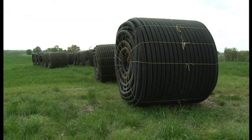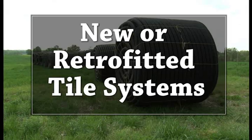I think what drainage water management does is give farmers the tools to actively control water — both excess and deficit — throughout the year, which they've really never had before. So it brings a whole new level of management capability to their operation. Water level and inline control structures can be used with new tile systems or retrofitted to existing tile.